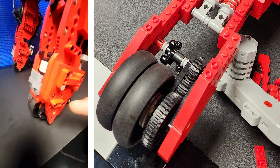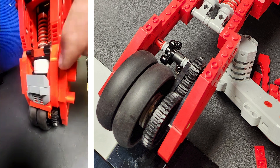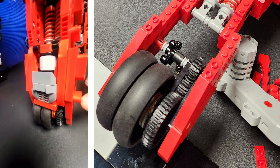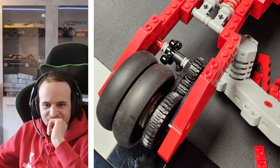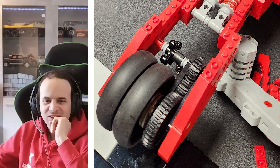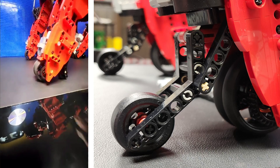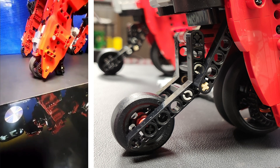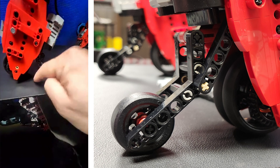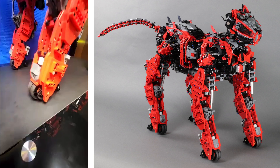Then there's a very simple gear train going. There are some knob gears transmitting to, I think it's an 8, 12, and 20 tooth gear, and then it goes to a 36. So these are freewheels — you get three times gearing down. It's freewheel because there's no worm gear or anything to hold the weight, so it kind of forms a tripod. The weight centers right in the middle. So it's quite fast — three times down.